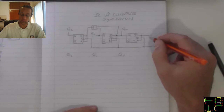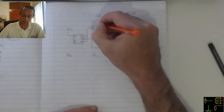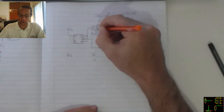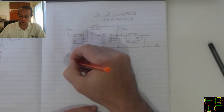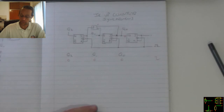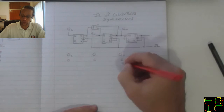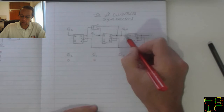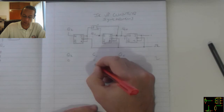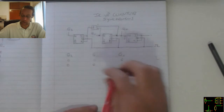We accept that it is currently in the off state or reset state, which means we've got 0 there, which means this JK is in the hold state. We've got 0 there. Because it's in the reset state, we've got 0 there, which feeds into that AND gate, and this one is also in the 0 state. So when we receive the first lagging edge trigger, this JK will toggle — that becomes a 1. This is still 0, so when it receives the clock pulse, nothing happens on this output, it still stays 0, and that stays in the hold state.